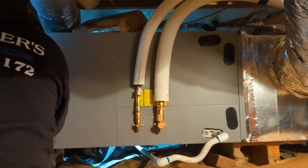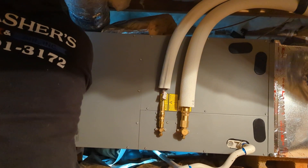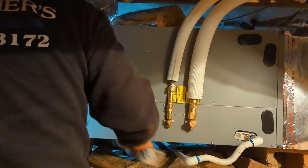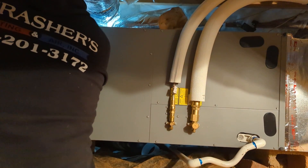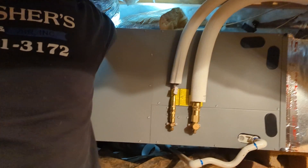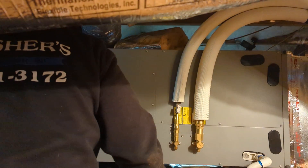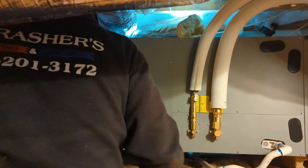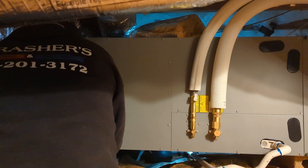We've been able to lower the load a lot. The air handler only pulls a little under two and a half amps. There are no heat strips in this air handler — it's just the variable-speed blower motor. This unit and the condensing unit outside are only pulling 12.5 amps for three tons. That's right where I wanted to be with soft-start — about 12 amps — which is about as efficient as I think I can get with heat pump technology.